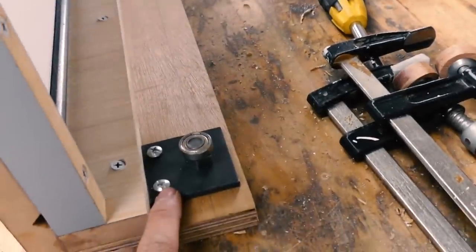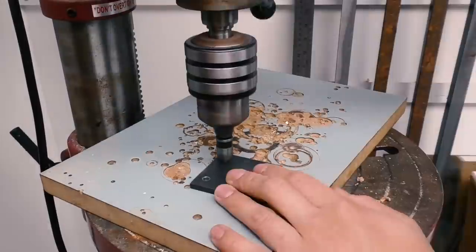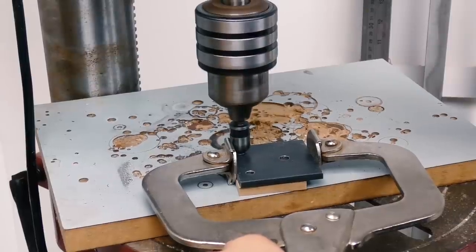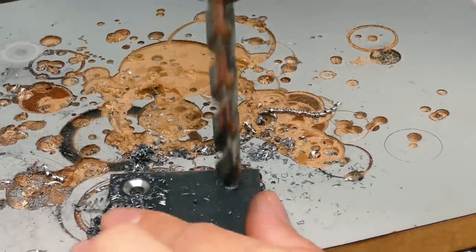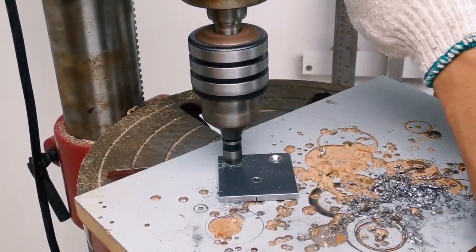And it looks like now I have to change these flathead screws to some countersink ones as well. For some reason, my countersink bit seems to be anti-lubricant. The moment I added some cutting fluid to it, the cutter stopped cutting. Using the countersink bit was also really slow, so I used a larger drill bit to ream it out a little first, then I swapped back to the countersink bit to finish it off.